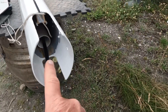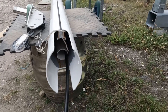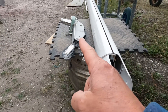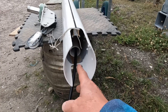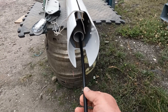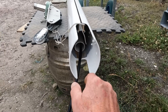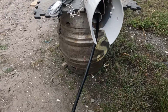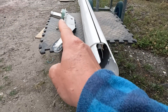This cable coming out of the tube at the top of the mast will have some heat shrink both where it's going to go through that hole in the head of the mast and then also just where it's going to disappear into the ducting. Where that is, I'm going to zip tie a bit of FR4 to it so that it acts as strain relief. The FR4 resting on the top of the tube takes the weight so this connector isn't taking any weight through onto the fitting.